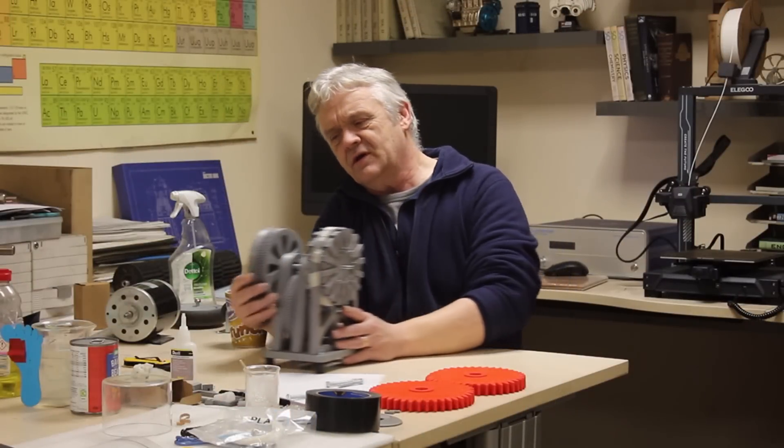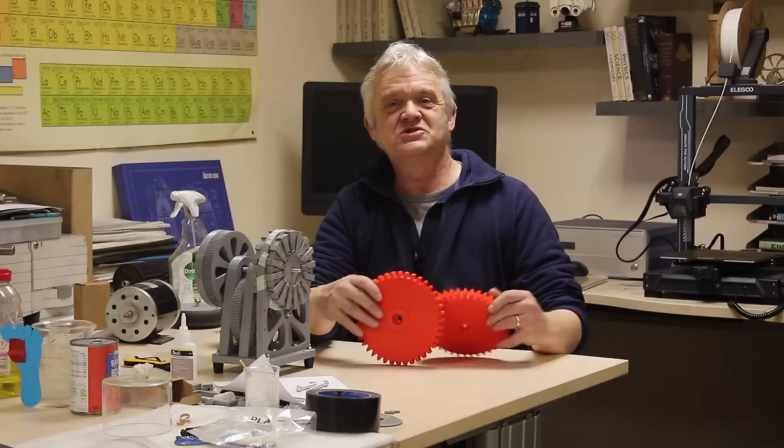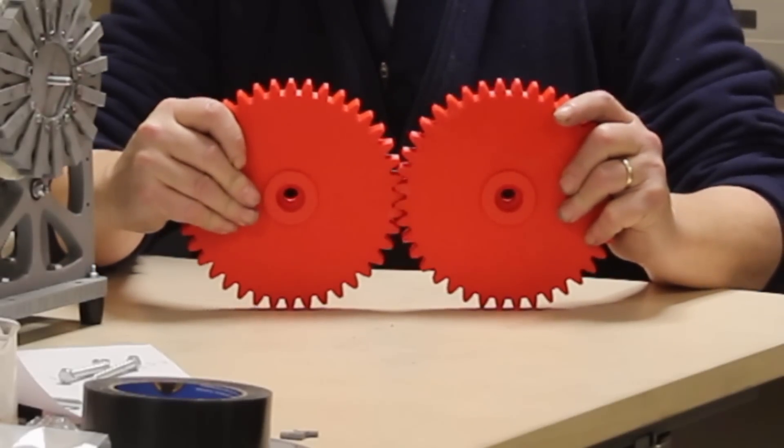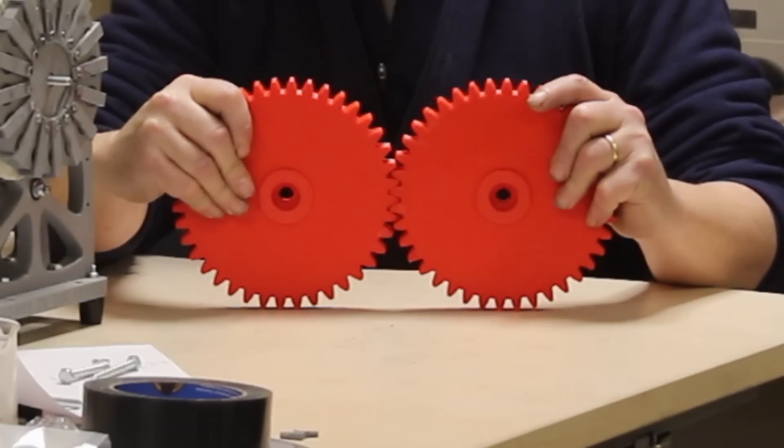What I want to do is make a couple of gears with great big teeth, something a bit like that. They're much bigger, much stronger, they engage much more positively, and they spread the force over the entire area of the tooth so they won't wear out as much.